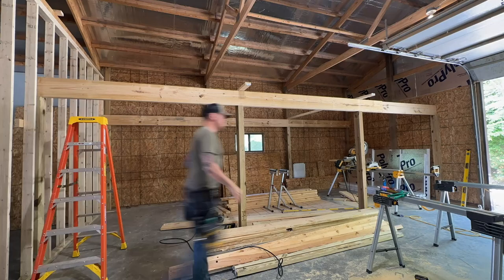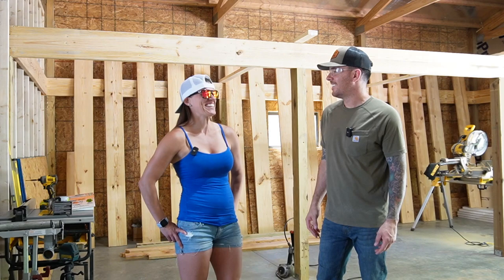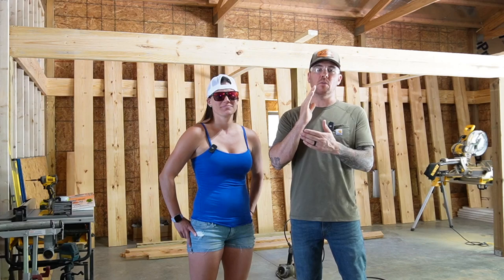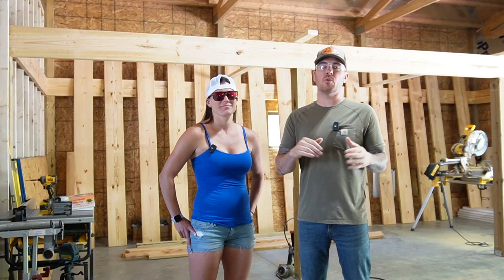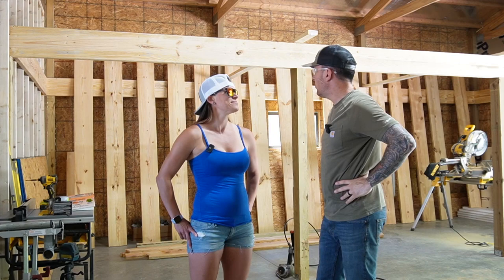I got the headers up — they're glued and screwed. I got the layout done, all the joists are cut, crowns are marked, and we're ready to start framing up the floor joists so we can get that loft floor on. I got my lovely assistant here — Keystone girl — and she's going to help me hold up these joists while I nail them in. The arrow means up — that's where the crown is at. The crown means the board's got a slight curve in it, so you want to put the curve part up so that when the weight sits on it, it'll force it down. If you put the crown down, it already has a sag in it.